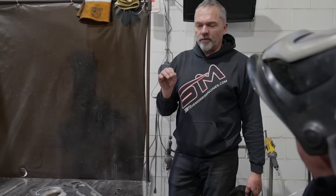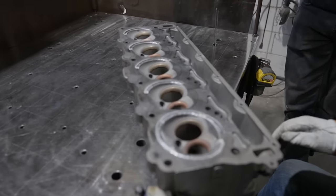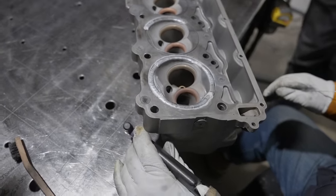So obviously I've got to turn my frequency number way up because that is what's causing me some grief. It's fast, and low profile. Yes, that's what I was getting at. It's such a low profile. And that's because of the frequency number. And you're on it pretty hard. It's like 180 amps right around there.